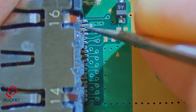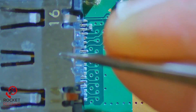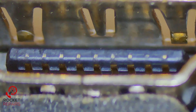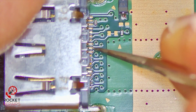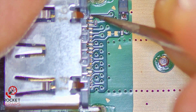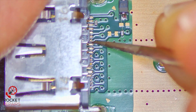Obviously the port's not going to work. It is entirely possible that maybe these have been pushed back by the plastic itself, but when I look at the actual port itself under the scope, this plastic bit - the inside of that port - is not wobbly, it's still really, really secure. We just don't have any visible damage. My moaning is really about the state of the factory soldering - it just shouldn't be breaking this easily. So many people come in and say 'my PlayStation 5 has just stopped displaying.' We just don't have the same experience with the Xboxes, and this has been happening since I started in September and even before then with the shop itself.